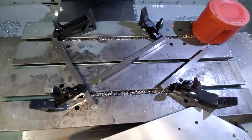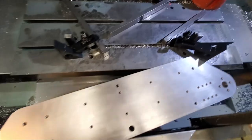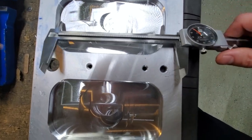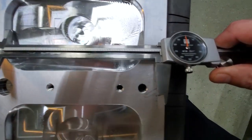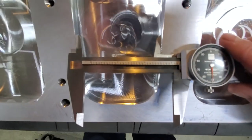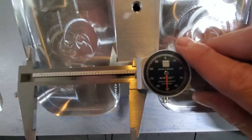Here are the blocks that are under the part and the toe clamps. Bear with me while I try to film and measure with eight-inch calipers — the pockets must be six inches on this side, which it is, right on six inches. And now to the other side we have three and a quarter, right on the money — that's what we're shooting for as my little drawing showed.